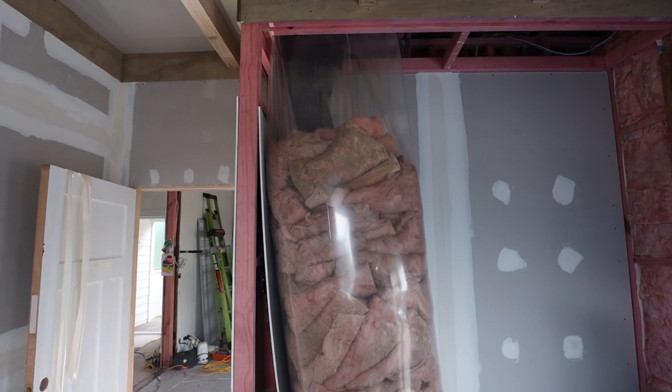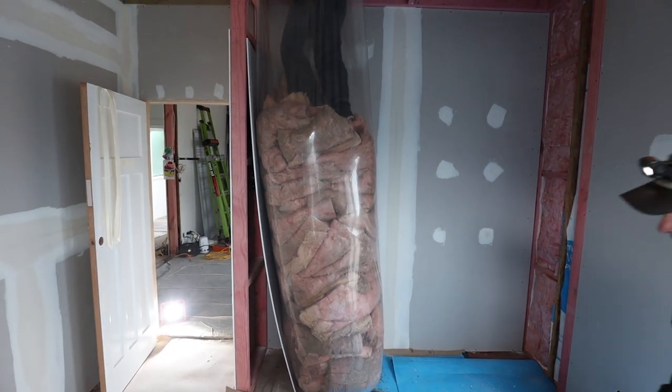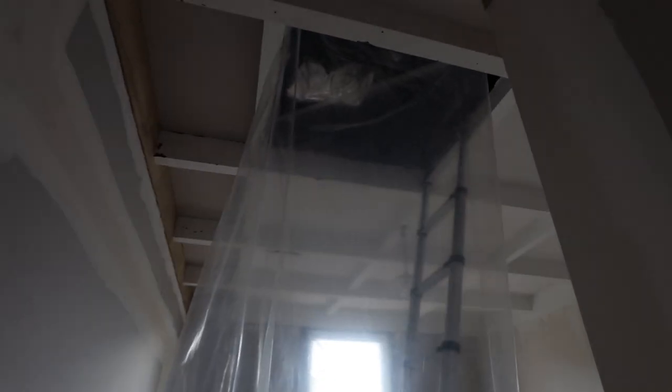In the walls is where a lot of houses in this country do not have insulation. Wall insulation is a lot harder to retrofit because you have to rip all the wall lining off and all the cladding off, so a lot of houses don't have it. But when we renovate like we are here, we make sure that we add it. In this case it's an internal wall — you have to insulate your external walls, the ones that go to the outside. The internal walls you don't have to insulate, but we did insulate it here for sound. It's called silencer insulation. That's the bedroom behind that wall and we're standing in the lounge — we don't want sound travelling between walls. So the client said, while we're doing all this, why not update the insulation so it's good for another 10 years.